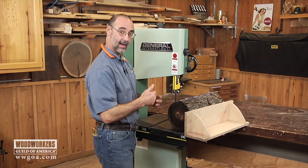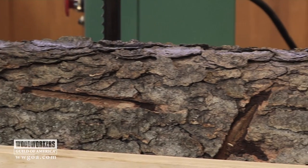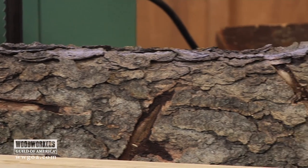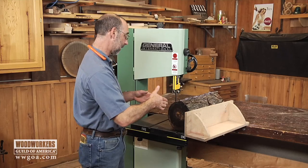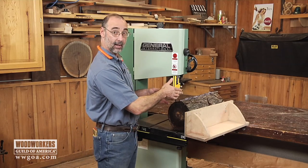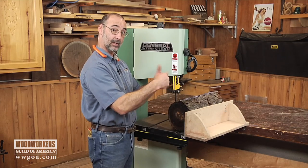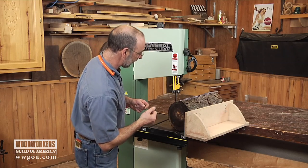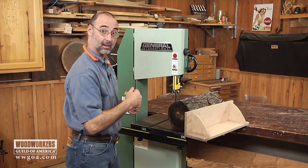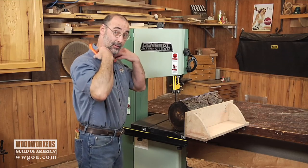Additionally, on the log, if you have a look at the top you can see this blue — I used a chalk line, a snap line, and I snapped a line from end to end. So my first cut through this log, which is a piece of cherry, is going to be just a freehand cut following that line. Once we've got it in half sections I'll show you how to continue the process to make it into planks. I'm going to spin this around, start the cut, and you can see just how easy it is to turn my bandsaw into a sawmill.